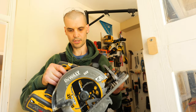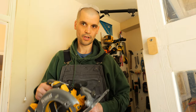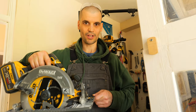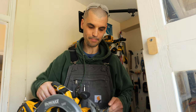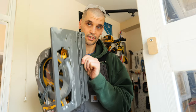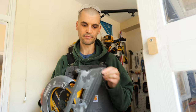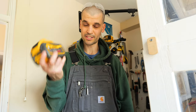You just saw me using my new circular saw — this is the DeWalt 54V FlexVolt DCS579, cordless. I was thinking of getting a plunge saw and I kind of wish I did, because doing bevel cuts on the floor with a track is a bit of a pain. A plunge cut saw would have been ten times easier. For a cordless one that's six to seven hundred pounds, whereas this was under 300 pounds. These circular saws are compatible with the rail, so it does kind of work like a plunge saw. It's got a nine amp battery — definitely enough power.